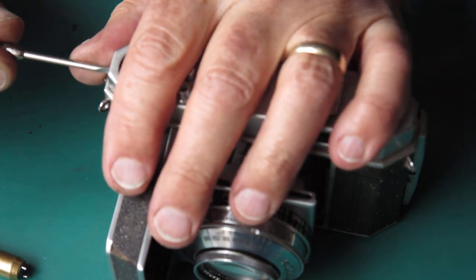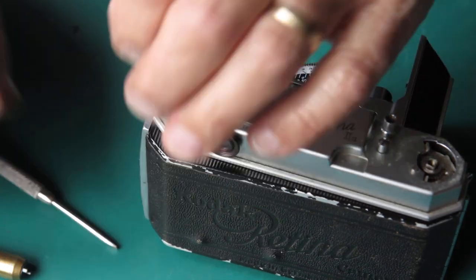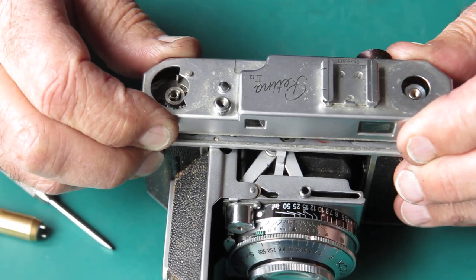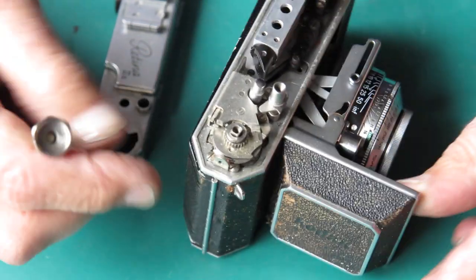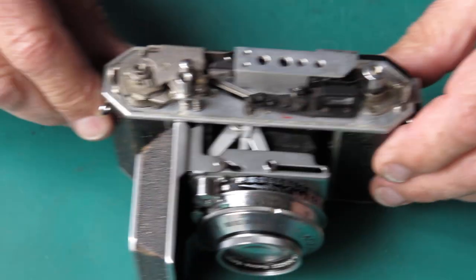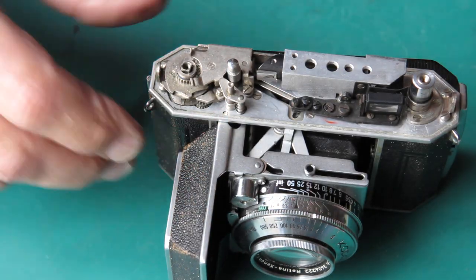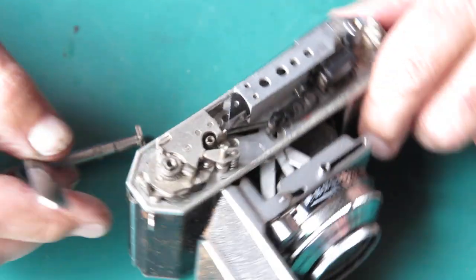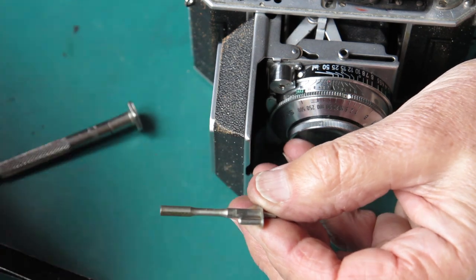Back to the top cover — one screw at each end, chrome plated, very short. If you ever have cause to replace one of them, make sure you use the original short one at the film advance end. Otherwise the film advance won't work, because there is very little clearance between this cam and that plate. So that's the top cover off. A bit grubby looking, nothing else important there. The shutter release is the button and its collar that sits on the top — that spacer is important not to lose. Re-release button and its spring — I'll put the spring to one side. Lift out the shutter release shaft, put its spring to one side. There's a collar here — it's important that you don't lose that.